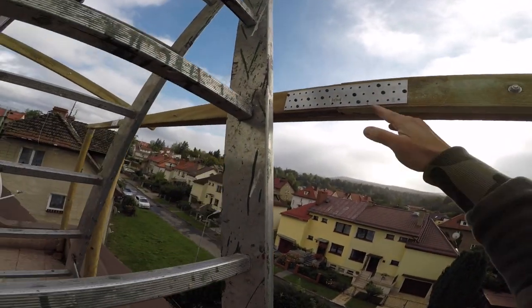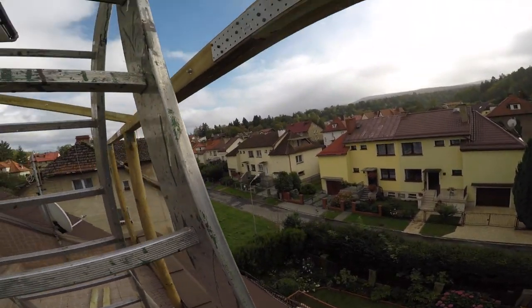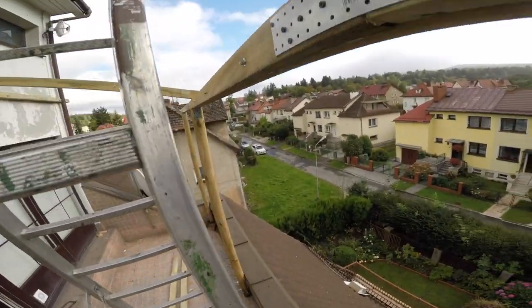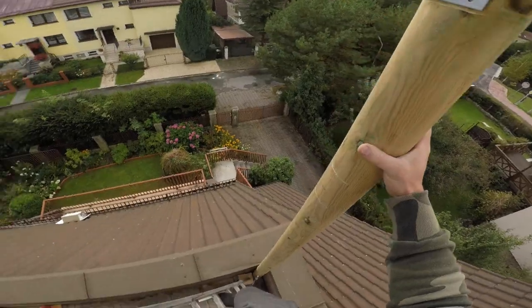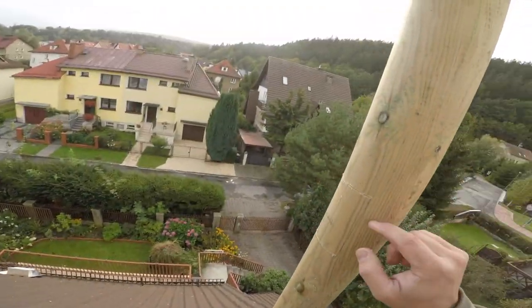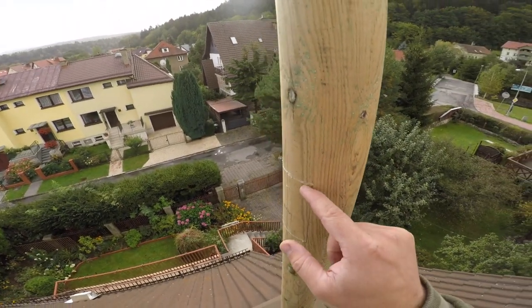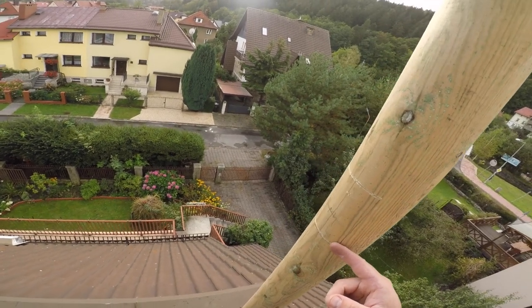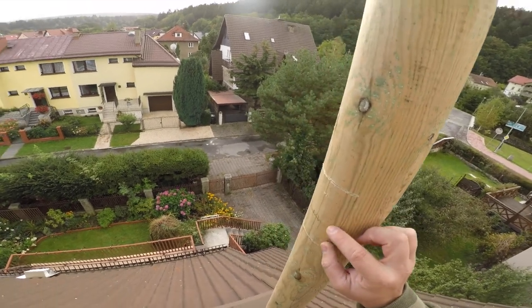So I'm just gonna put a beam across, you know? To reinforce it, and it's gonna be one here and one on the other side. I've marked this and cut here and here. Now probably I'm gonna go with a drill like that multiple times and then put the pendular saw on one side and on the other side to make this straight bit.